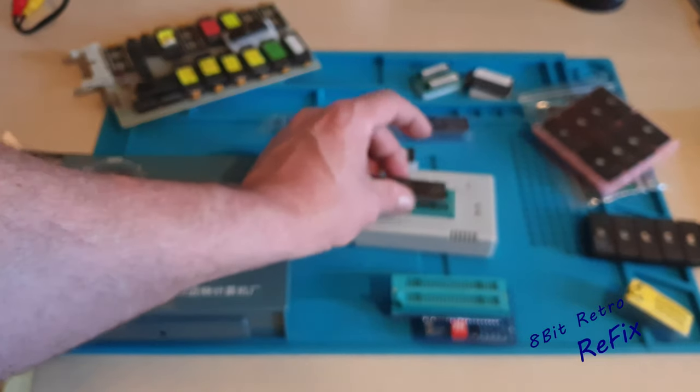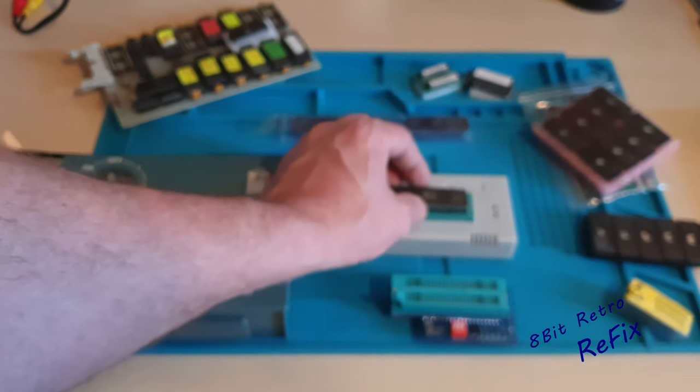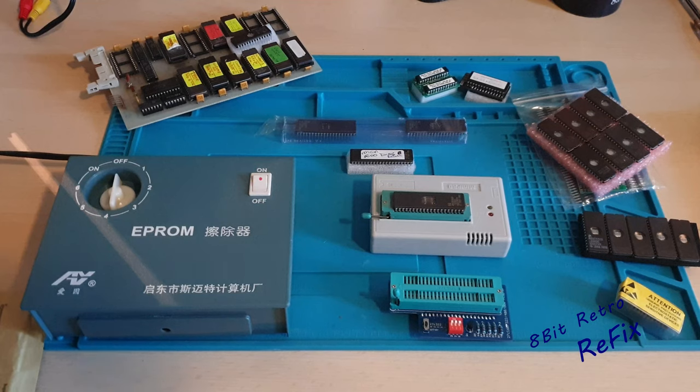So I bought this and thought I can now put one of these chips in here and program it - but it didn't actually go that well. Not knowing anything about doing any of these chips originally, I was completely clueless - we're all self-taught. I thought it was my drivers on my PC, but then I started looking around on the forums and realized that these chips are not actually compatible with this programmer. When we go over to the PC screen I'll show you the window where you can go in to change all the chip names, and when I searched for that chip number - it's just not there.